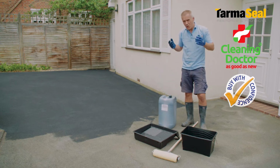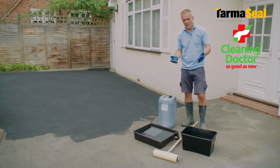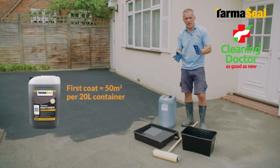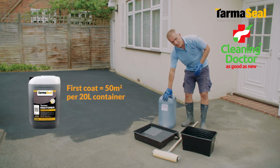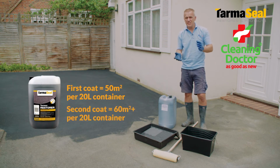Now, we always recommend 2 coats, and if you work on the basis the better the condition, the further the product is going to go. It's best to average out on maybe 50 square meters per container, a first coat, and a second coat could be 60, 65, maybe even more. It all depends on condition.